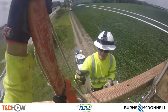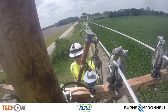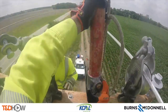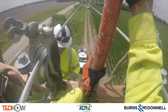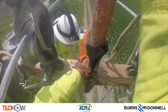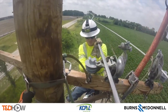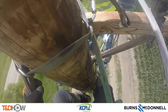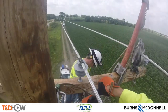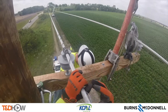Now we can move the arm buddy from this side of the cross arm to the other side around the pole. As you see, we have two phases on dollies as we position the arm buddy next to the outside phase. But we will show you first the movement of this middle or B phase. In this case he doesn't need the arm buddy because they're not leaning out far to the end of the cross arm where they need leverage to deal with the strain of moving the conductor. They tie in this middle phase here.